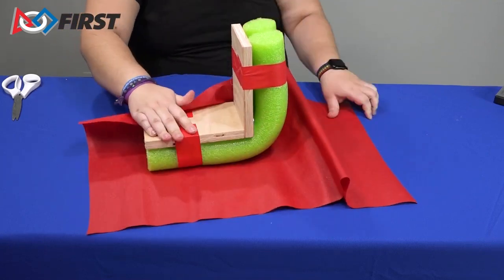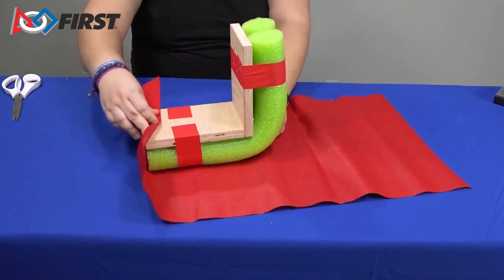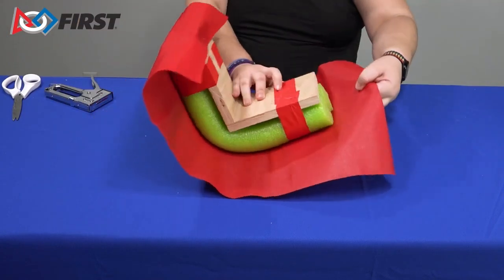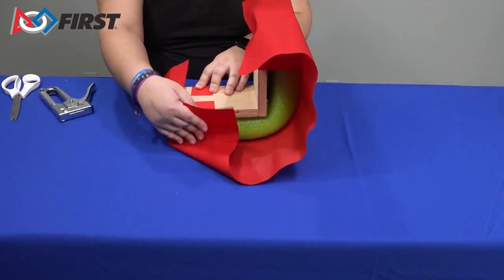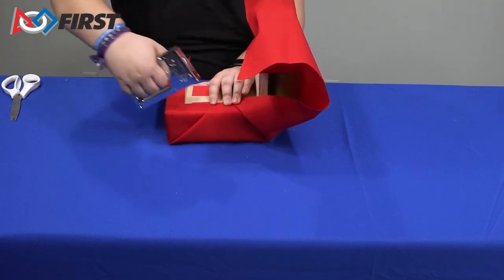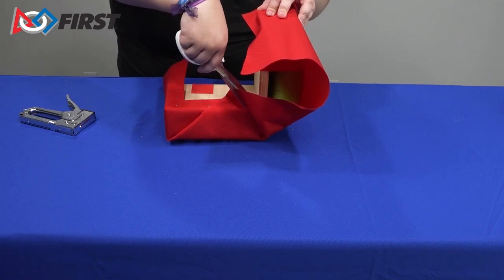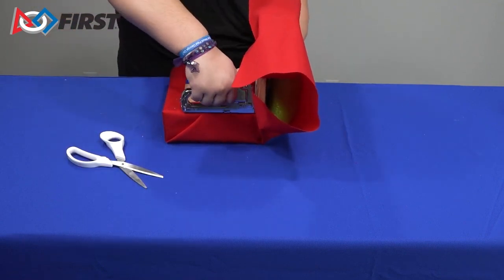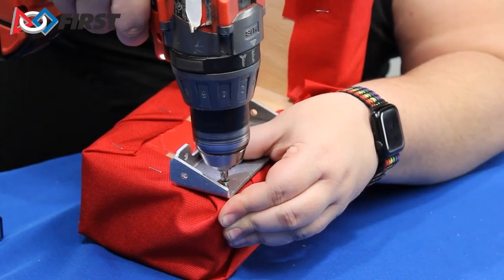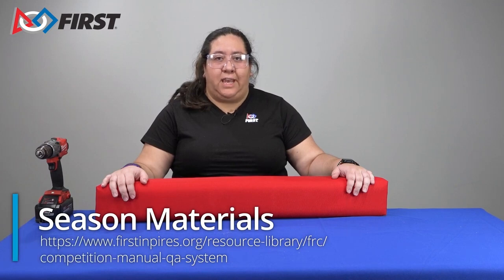It is also possible to start in the center of the corner and work outwards. To start from the edges and work in, center the bumper piece. Start on one bumper end and staple in place, then wrap around and staple the other edge. Fold around the corner with crisp edges to your folds. Cut a small relief in the fabric to allow room for staples later. Staple this edge in place and repeat on the other three edges of the bumper. Reinstall the brackets and make sure that the bumper fits on the chassis. Make sure to check out the game manual and the robot construction rules for all the specifications for how to construct your bumpers, and check out our bumper mounting video as well.